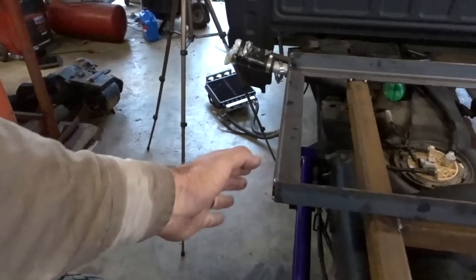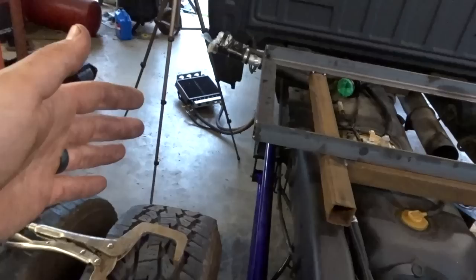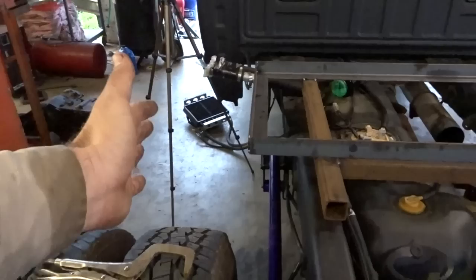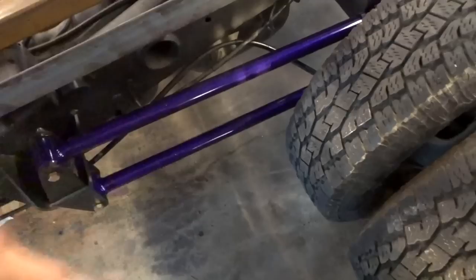So therefore, you can kind of see, I think I'm about an inch and a half off that bracket there. That way, obviously, it doesn't interfere with that. But what I'll do from here is I'll drop a plate straight off the side of this, and then build my lead well here, where all my leads will roll up into, and then I can come back and I'll put a top plate on, step it off the side a little bit, cut some circles in or whatever. But that's just an easy, not easy, but that's how I kind of do it.